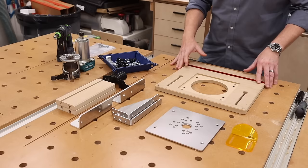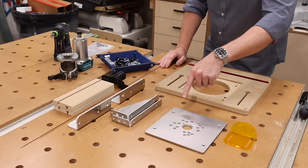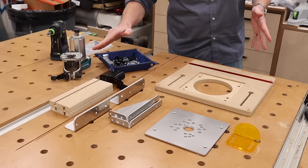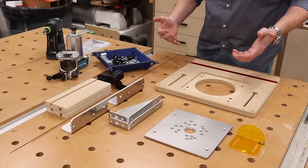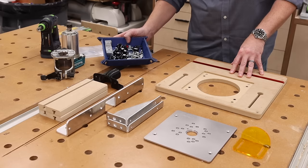When you get your router table, it's going to come with multiple components. We have the MDF router table, a guard for the bit, and the plate which connects to multiple different routers. The one I'll be using is the Makita because I don't love that router for other uses, so it will be my permanent router for this table. These are the two brackets that connect to the table itself, which will connect to the MFT. Then we have our aluminum fence, sacrificial MDF pieces, dust collection, some different plugs, and a nice assortment of hardware — all of which will be used to assemble this.